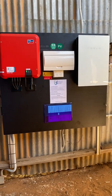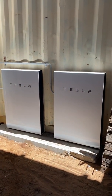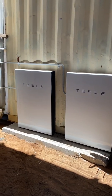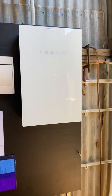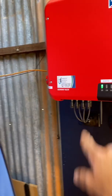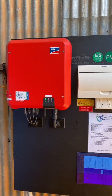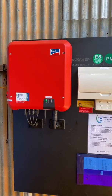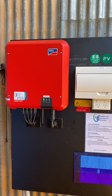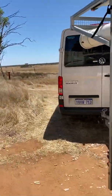With this install, we've got an off-grid system using two Tesla batteries — 27 kilowatt hours of storage in total. That connects to the Tesla gateway here, which is the brains of the system. There's a lot of electronics behind there that feeds the switchboard, and then we've got the SMA 6 kilowatt inverter. Up on the roof we've got 8 kilowatts of solar panels — LG Neon H's.